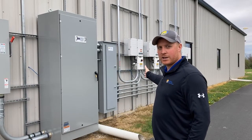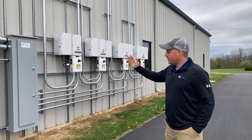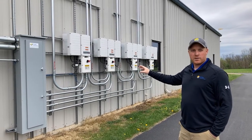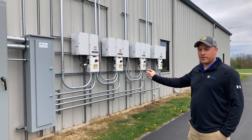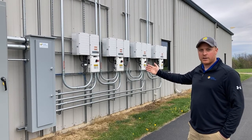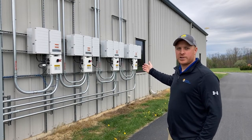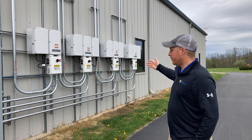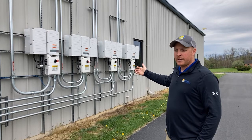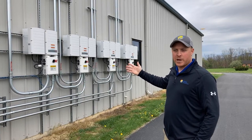Walking down the length of the wall, you have your switch, your relay cabinet, and your main electrical panel for the solar — which is just a breaker box, one breaker for each solar inverter. They all collect their energy together, and then you go to a main circuit breaker that turns the whole system on or off. Finally, the last thing you come to in the electrical layout would be the solar inverters. On this particular project we've got four solar inverters, between 60 and 100 kilowatts of power in each inverter — which equates to somewhere between 6 and 10 houses worth of power per inverter.